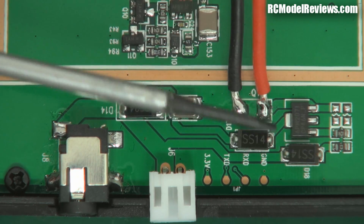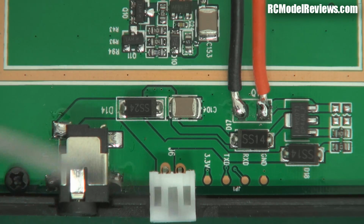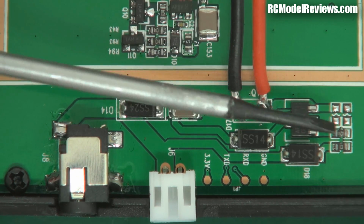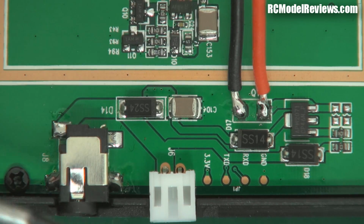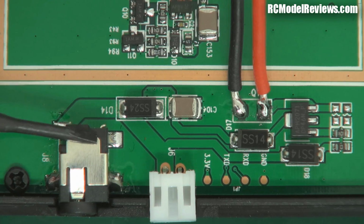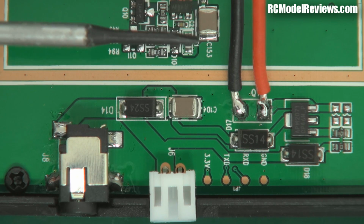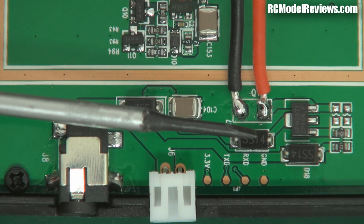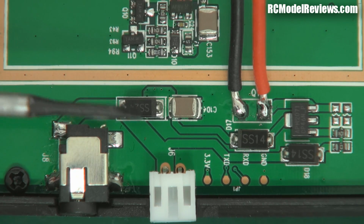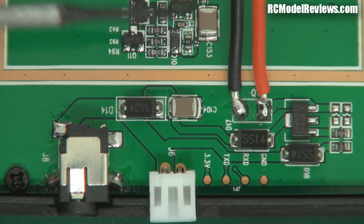So we need some extra circuitry here to make sure that only one battery at a time is connected up to the rest of our circuitry. That's where this little switch comes in. It appears they've got a little FET switch here which detects which source has the voltage applied, whether it's these 2 connectors or whether it's the internal battery, and then switches that accordingly into this piece over here, which is where the actual power supply circuitry goes on. But you'll notice there's another diode in here. So in effect, we end up with 2 diodes in series with the battery voltage that goes off to the supply. Now, I want to talk about barrier potential because it's very important.